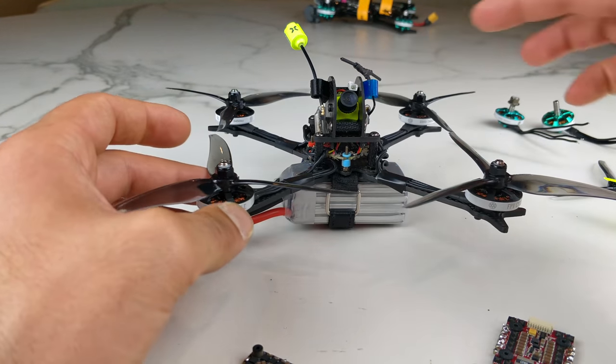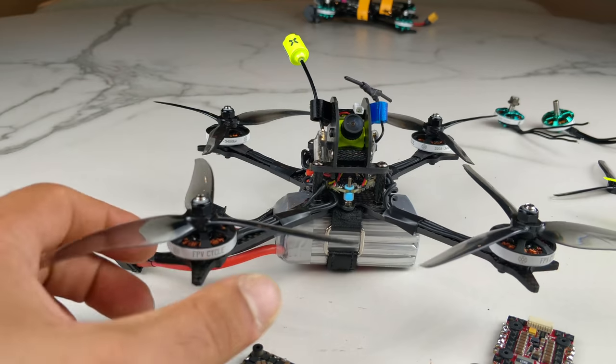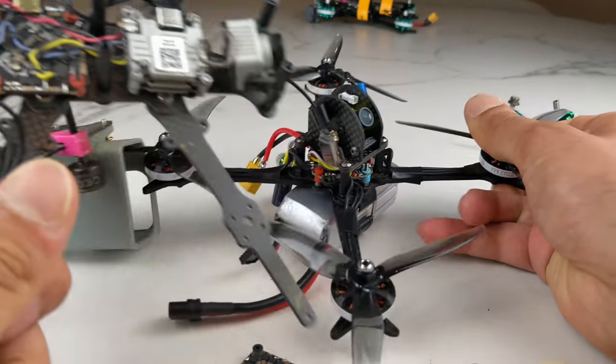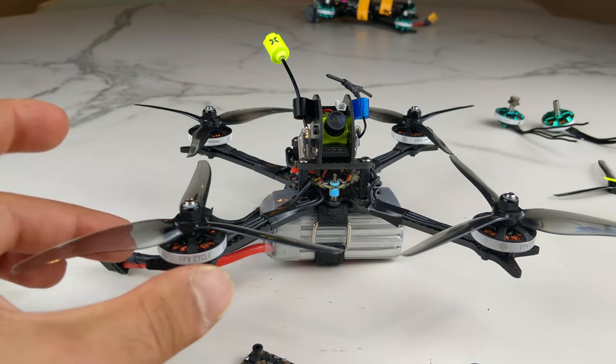It's pretty light, but not really an ultralight. I don't really subscribe to the 250-gram mark for these sort of ultralights. The reason I don't call it an ultralight is because I don't really sacrifice motor weight for lightness. This particular quad I would consider an advanced build — advanced to process and tune and get to fly appropriately. I would not recommend this to a beginner or even an intermediate, or somebody not willing to put a great deal of effort into making this thing work properly. Also, the motors were never designed for this particular purpose — they were designed for a Cinewhoop.